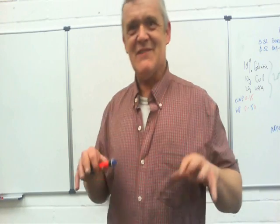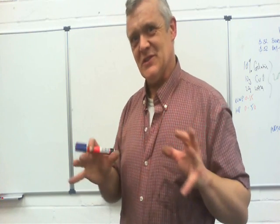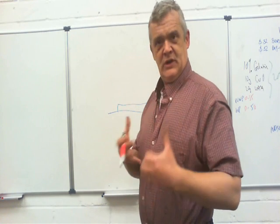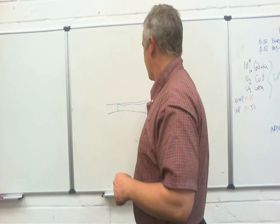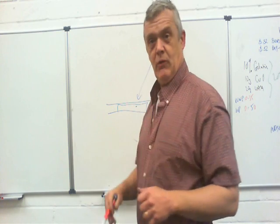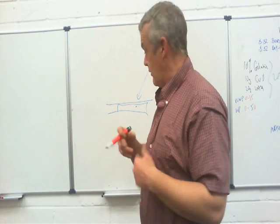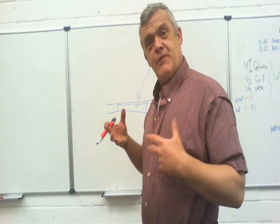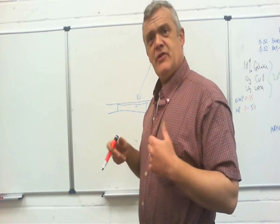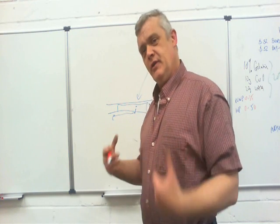Now the reason I redesigned it really was to do with some thoughts I've been having. When you look at a traditional solar cell it's essentially three plates: you have a flat plate current collector, some kind of photo-active material, and then another flat plate that is see-through on top, because when the light comes through and hits the material, it essentially knocks out an electron. You've got to get that electron out to do some useful work before it recombines. So there's a big problem in giving it enough of a chance to escape before it recombines, and the way they traditionally deal with that is to make this distance very, very thin — that way the current collectors can grab it and whisk it off before it can do anything else.